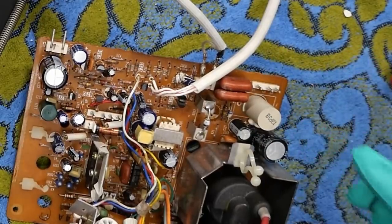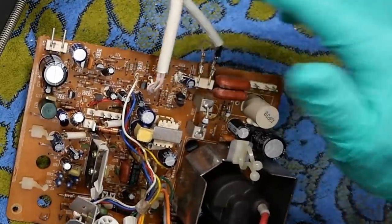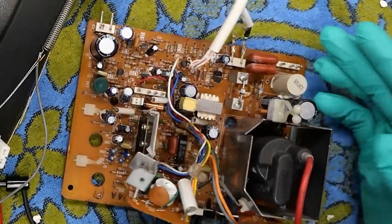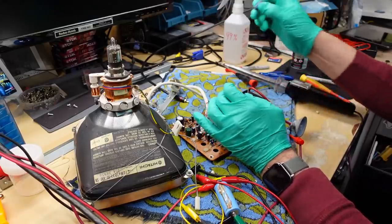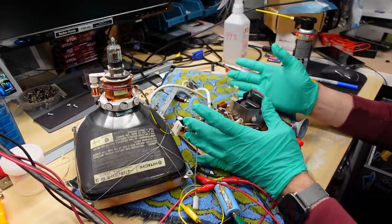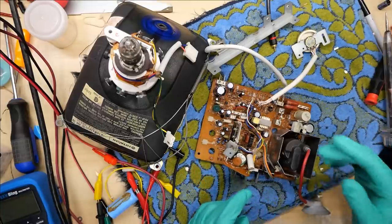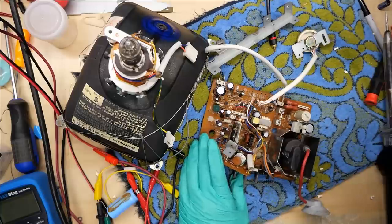This section of the board is clearly the horizontal drive for the display. And this is where the deflection yoke horizontal hooks up. And there are some high power transistors right there and these capacitors. So this little section right here with these transistors probably creates the horizontal oscillator. Without the horizontal oscillator running, you're not going to get high voltage. And this capacitor — which is just a 47 microfarad, 16 volt — is probably necessary as part of that circuit. When I was powering this thing up off the bench power supply, I wasn't getting any high voltage at all — the oscillator was not running. So I'm going to say that was the problem over there. So I'm going to clean that up a little bit and pop a new cap in there, and we'll just see if any high voltage is generated by this. Because after that little testing when the B+ was overvolting, there has not been any more high voltage out of this monitor since.